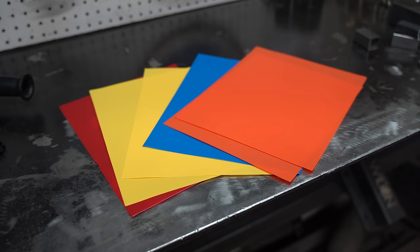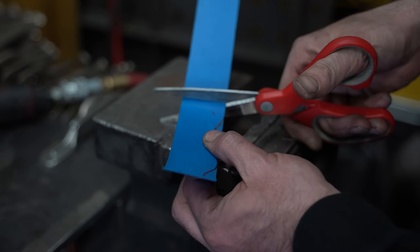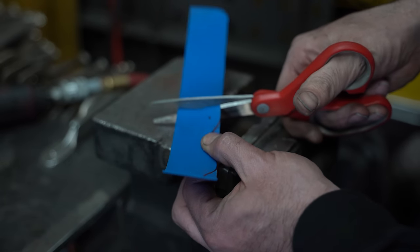Making the template is about as easy as it gets. I buy three dollar plastic folders from Walmart just for the material, which I use for templates I reuse a lot. Cut a strip of material long enough to completely wrap around the tube you're working on and wide enough to completely cover the notched section of a pipe that has already been notched — plus another inch or so for rigidity and for a place to put tape. Wrap the material around the tube that has been notched to the angle you desire.